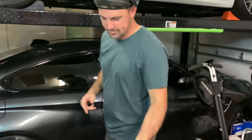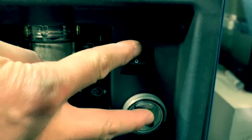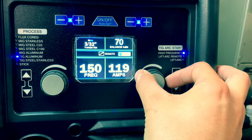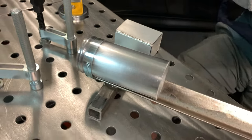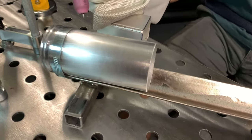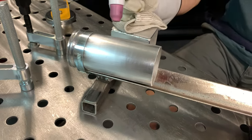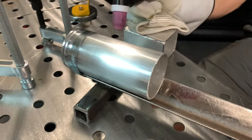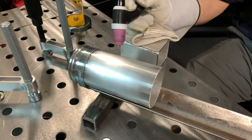So here's going to be the man behind the torch today, my buddy Chris — guysofficial.com. And just like we always do, the dramatic cinematic video. For this test we're just going to use some scrap round tube — a little two-and-a-half inch tube. Basic clean up and prep. Just going to make some straight beads, not going around it, to show you basically what you would be welding in the real world — like welding up some charge pipes. This is probably more realistic than welding on a flat piece. We're going to run two passes with 4043 and two passes on 5356 so you can see the differences.